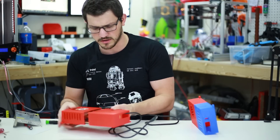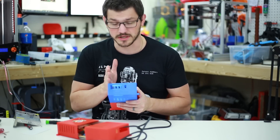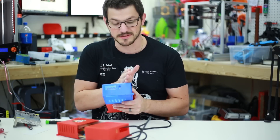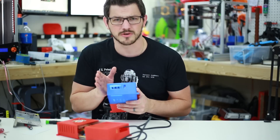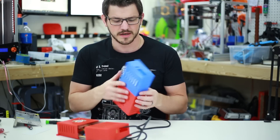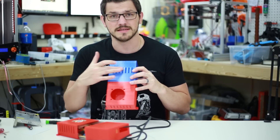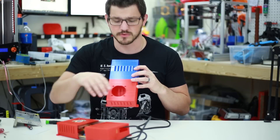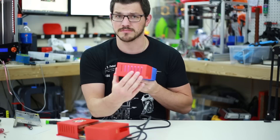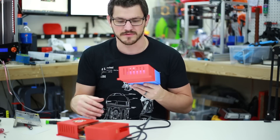Let's talk more about the final version. I rearranged the back — the AC in is on the AC side of the power supply, and the DC out is on the DC side. It just makes wiring a little bit cleaner; it's not crisscrossing underneath. I changed and made these ventilation openings a little bit bigger on the top to pull air through. I added ventilation to the side of the back and large ventilation in the rear — most of this is to allow air to get into the chassis at the back end.